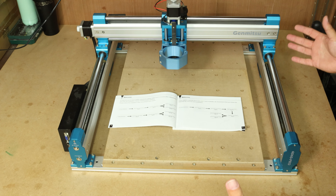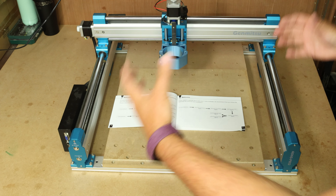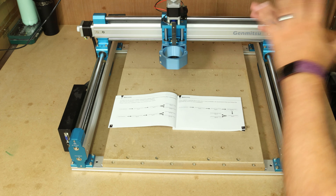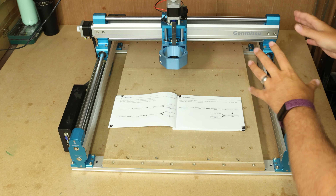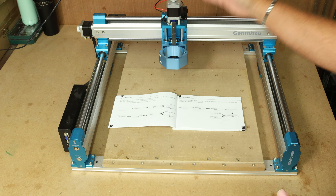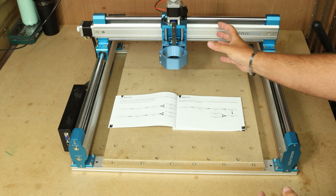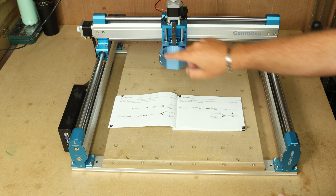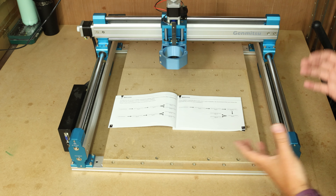Because we are doing both the x and the y-axis, we've basically got to strip all this back down to its basic components. We're going to start by taking the z-assembly off, then the x-axis, and then break down the y-axis as well. There are some bolts that come with the extension kits, but every time you take a bolt out, put it back in its original hole as soon as you have the opportunity — this guarantees you don't lose bolts.